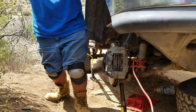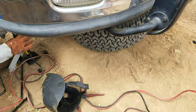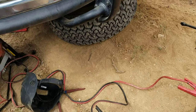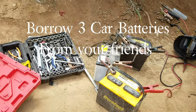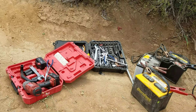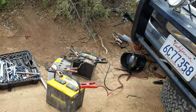If you are interested in this little video, let's go have some fun. So to weld something like this out in the trails, you'll need two sets of car battery cables — one set being modified to take a welding rod so that you could steadily weld. And then you'll need three 12-volt car batteries that are in good condition so that they can put out 36 volts and a lot of amps. So this is what I'm doing — I arrange them in a series circuit like this, and then I start to weld.